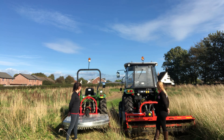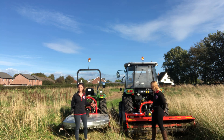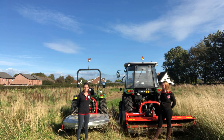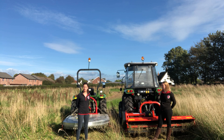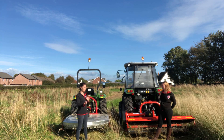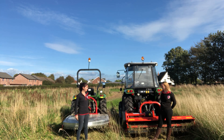Another big advantage of the topper is the speed you can work at. If you're pushed for time and need to do a quick job, you can move a lot quicker with the topper than the flail mower, and you don't need as much power to run it. This is due to the blades — once that blade is moving you're working with the momentum, so you don't need an awful lot of power to keep it going. If you want to work quickly, this is the machine to use.